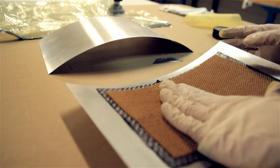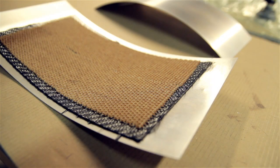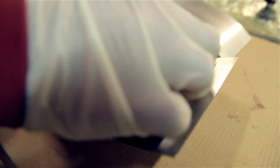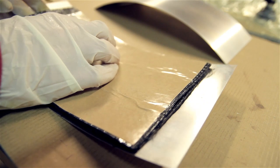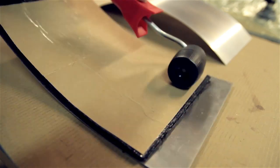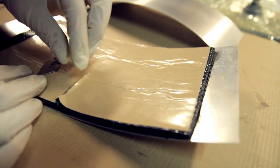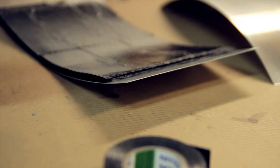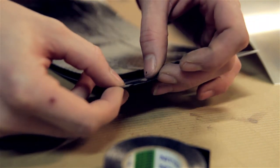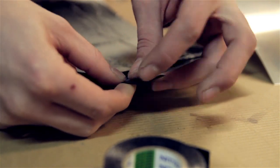If you don't place them flush together you will have an open line and resin will just fill everything. In this case I think the Pre-Preg filled some of the Nomex. So you won't get a perfect cosmetic part doing it this way, but if it's more for structural parts you should be perfectly fine. You save a lot of time compared to infusion with Nomex.